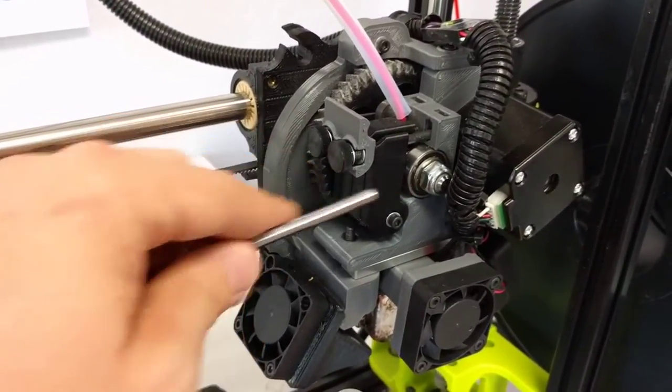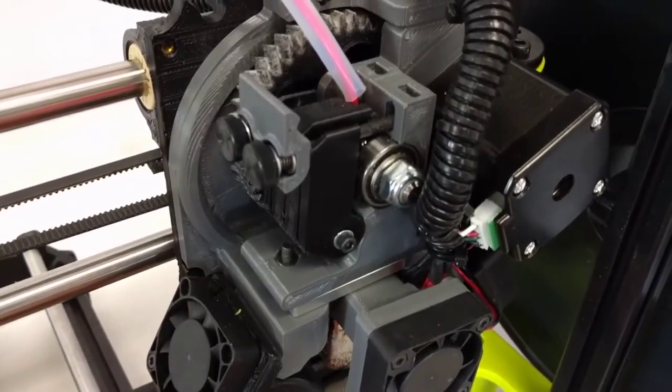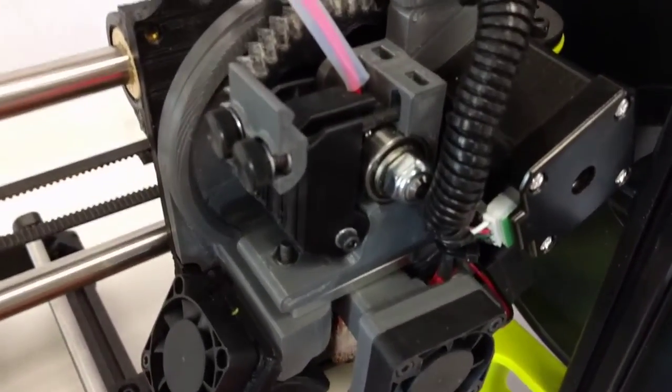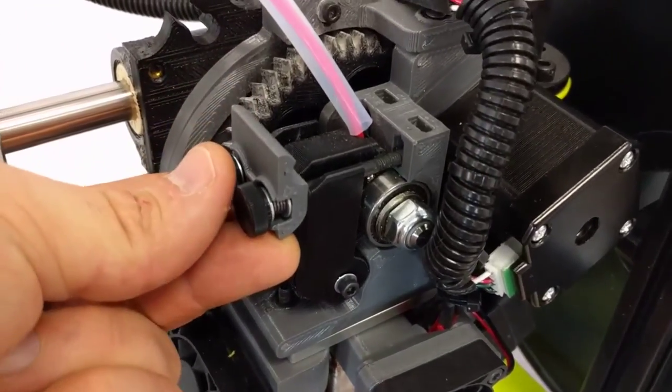You can see it right here. The bolt has ridges on it that can become clogged with plastic. You need to clean off that plastic for best performance. You usually want to do it if you hear popping and ticking.